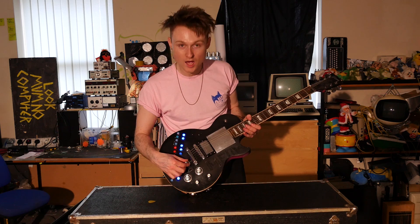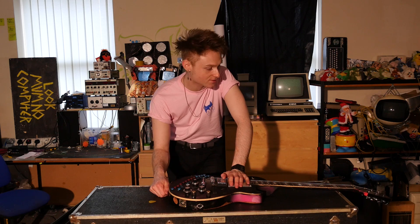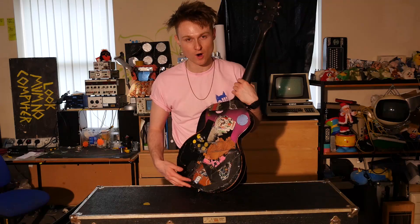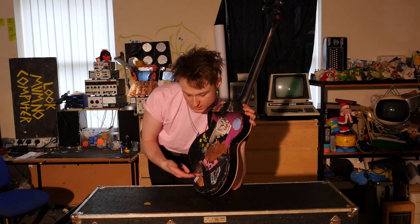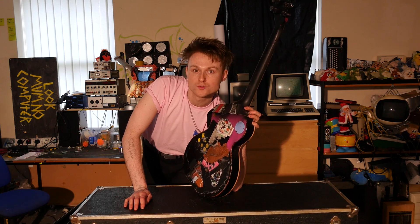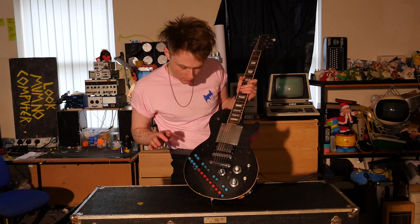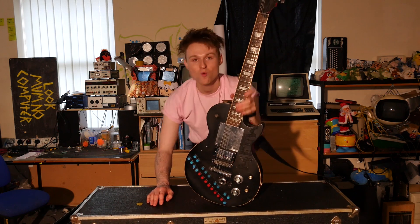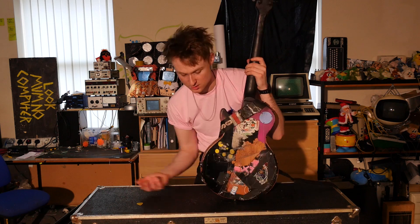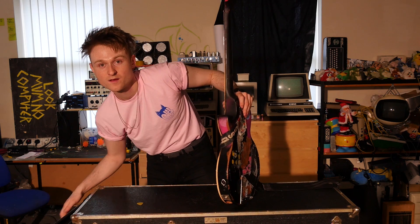In here is a MIDI controller drilled into a very expensive guitar. In the battery bay there's a hell of a lot of wires — I haven't bothered rewiring it, it's an absolute mess. The digital microcontroller inside, which is an Arduino, has a lot of inputs. But what if it was a whole keyboard — like 88 buttons? The microcontroller reads them and turns the input into MIDI data, which comes out into a synthesizer down here.